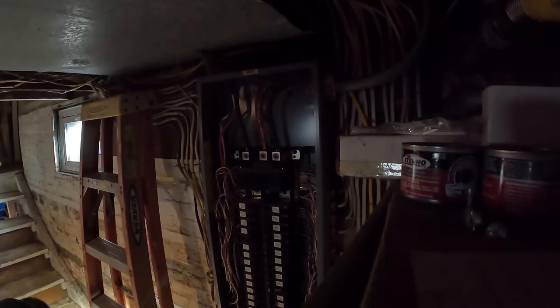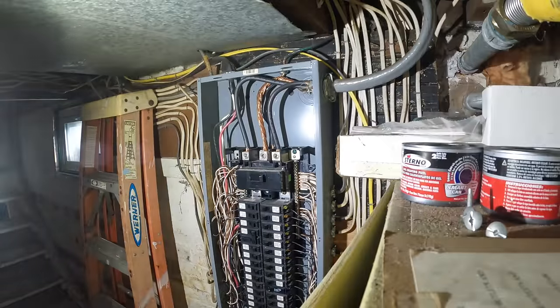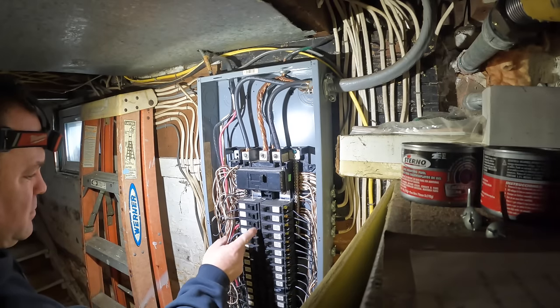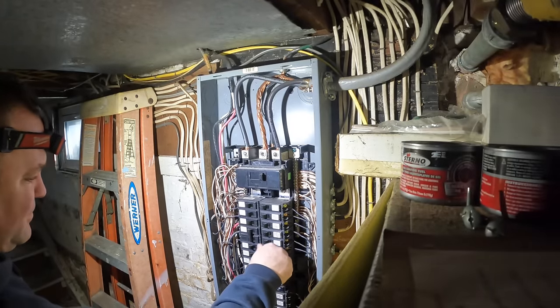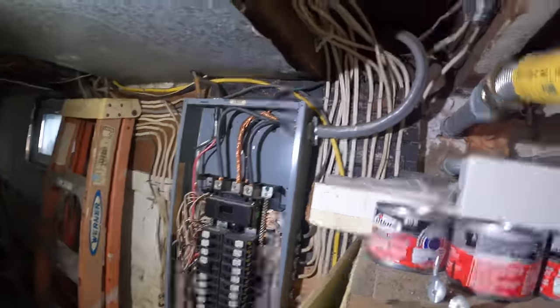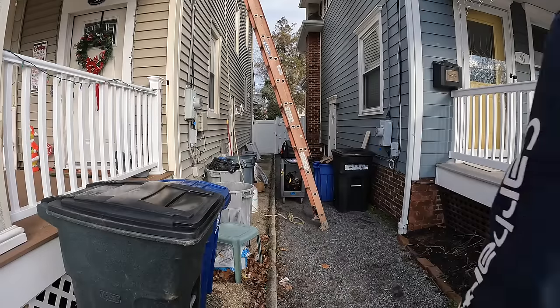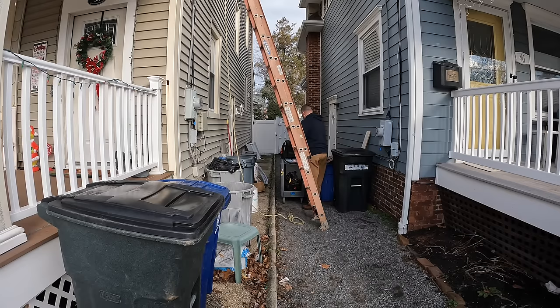The connection for the grounding electrode to the water pipe is for lightning strikes and induced voltage on other lower or higher voltage lines due to lightning. But it is connected to earth, and so the return current will return through the earth back to the source, up the grounded leg on a utility pole that's usually located every, I think they want four of those grounding electrodes on the utility side every, I think 25 feet, or no less than four every 100 feet. I believe I read that in this handbook that I have. But I'm not an expert in that department.